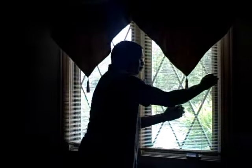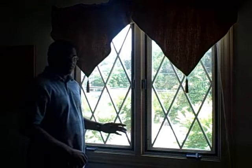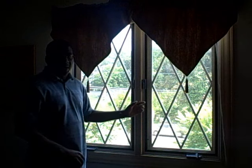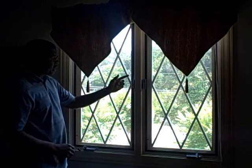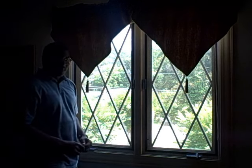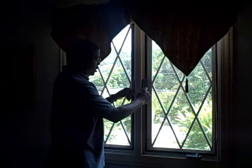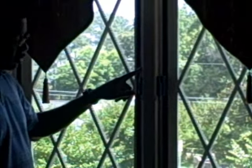Let's get started using the Blackout Easy window cover on casement windows in my own home. The first thing you notice about casement windows is you have both a left and a right side, so it will require two window covers. It's the same process — measure the frame inside to inside, left to right, top to bottom on the inside of the frame. Also, casement windows have locks, so make sure you apply the hook and loop tape working around the handles.